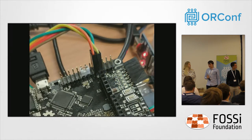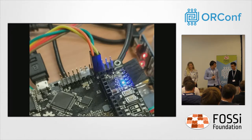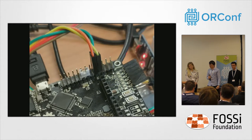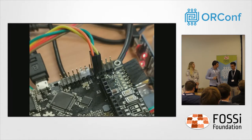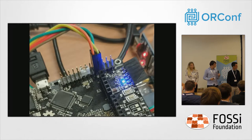With the rest of the day, we introduced some basic Verilog, making some LEDs on the MyStorm flash. In the afternoon, Philip introduced how to program a UART transmitter and then the corresponding receiver. On the second day, we started implementing the EDSAC peripherals, and Peter will talk to you about that.